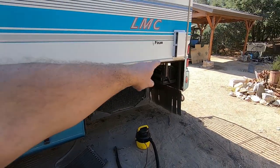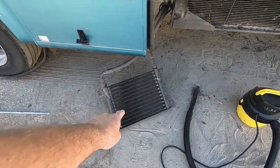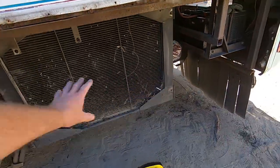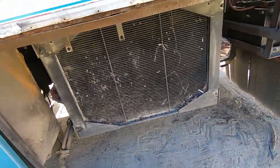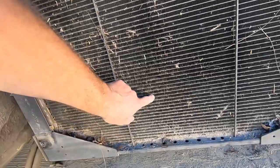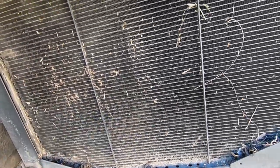We had to remove the whole quarter of the bus and pulled off the transmission cooler — four bolts. But look at the radiator: it is just impacted. Anything you see with white on it — those tubes are actually plugged up. I'm calculating probably a quarter to one-third of the radiator is plugged up, so we're going to get that cleaned out, which should eliminate our running-hot-going-up-incline problem.